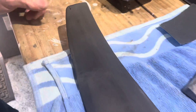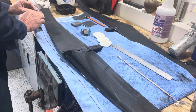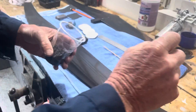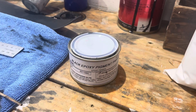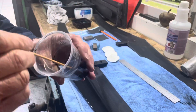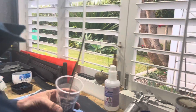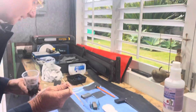I'll do the same on this side with my 400 grit — identify all the pitting and all of these little spots. Just over here I've mixed up some epoxy resin with a little bit of black epoxy pigment just to make it black. I have my kebab stick and I've mixed it so that it sort of hangs and drops — I've thickened it up with some high density filler. Notice how it just nicely hangs off the tip. So now I'm going to come to these tiny little pitting holes and drop a little bit of resin into each one.